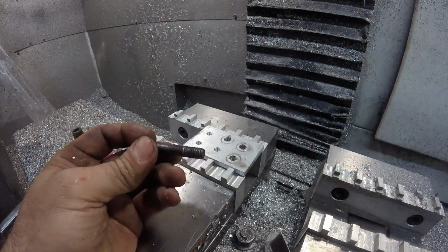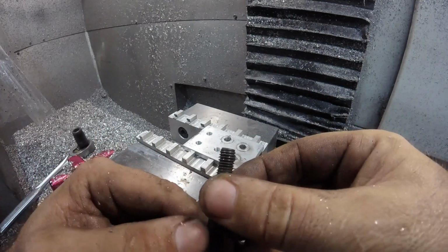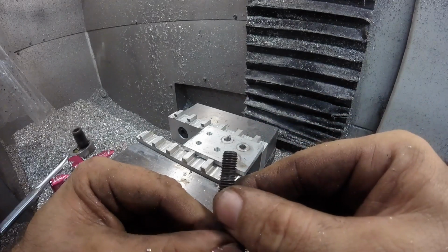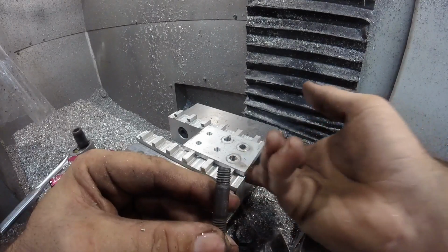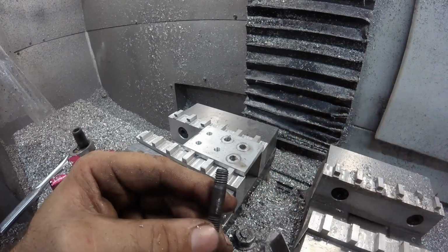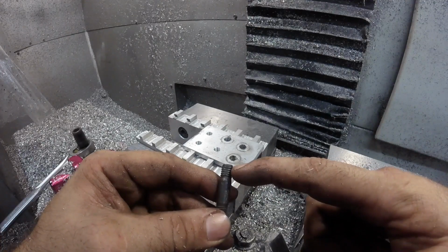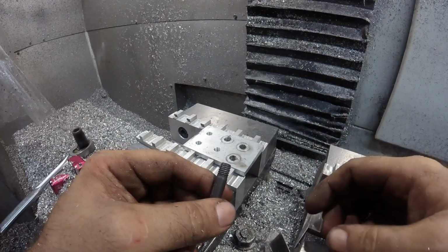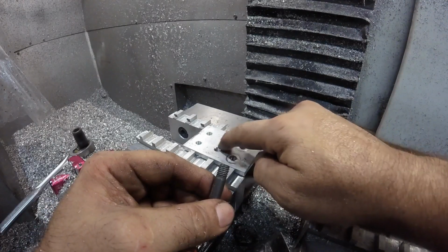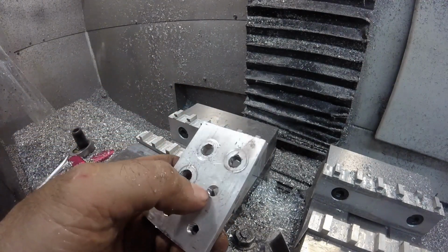One last thing I'd like to try. These studs, like most studs, I have chamfered in. Now this was long enough to go through and have about a thread sticking through. But if it were to bottom out, like say this quarter inch plate was up against something and the threads couldn't poke through the bottom, then this partial thread right here would be at the bottom of the hole, reducing the number of threads in the hole. Also, I normally countersink my holes, thus removing a tiny amount of thread on each side.